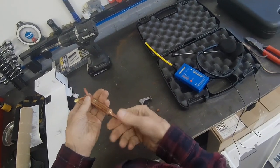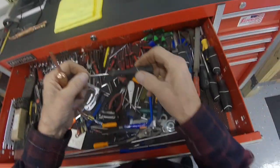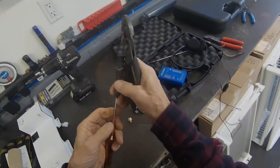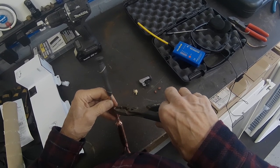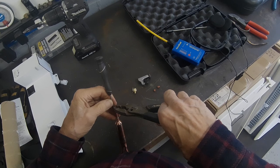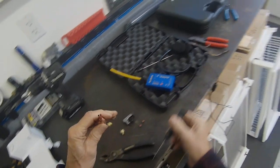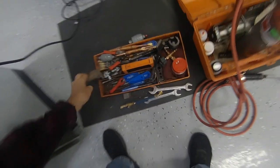Gee. All right, so what we could do is take an awl, something like this, put it in here, and crimp it on each side, because you don't want to put the cap tube in here like that and then wind up filling it with solder. That's not going to work. We can do that, and that reduces the hole. Just make sure you solder on that end. Okay, so let's get some sandpaper and prepare for welding.